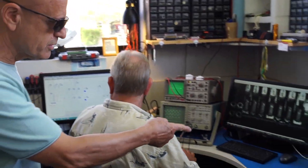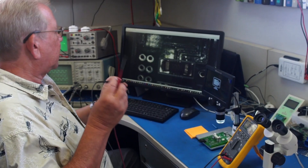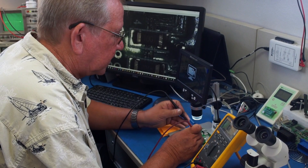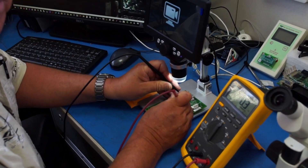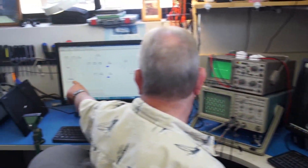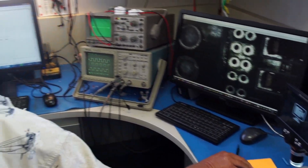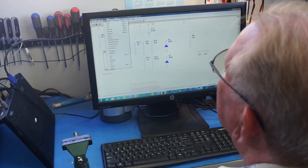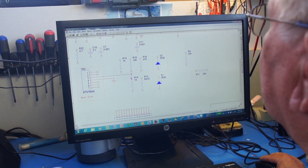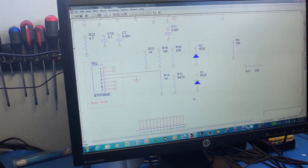In this case, you can see the board is extraordinarily small. Al is tracing connections — going from this pin here on R14, as you can see I have touching there, and going up to find out where we have contact. We have pin 3 of TR2 right here; pin 3 goes off to the top of R14. From there, I'll draw the bus line for that. And that shows the connection of the bus that is on the board.